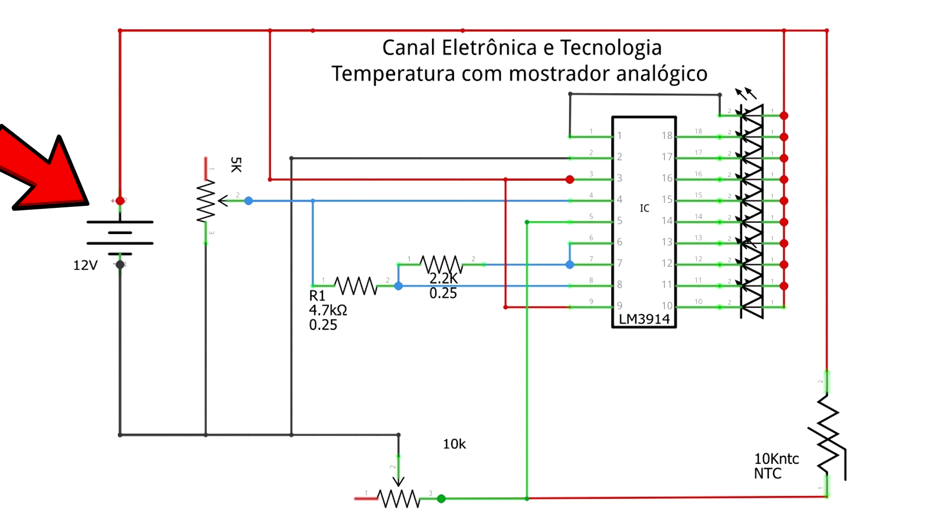For our tests, I'm using a 12V source. I could use 5V or 9V — there are no problems, though the resistor system may need to be altered. If I have a circuit with a higher voltage than 12V, I can replace it with a LM7812 to regulate to 12V. Beyond the resistors, I put two trimpots: one of 5K to regulate the base reference, turning on pins 4 and 6, and cascading with pins 7-8. I also put a 10K trimpot where I'm going to measure.